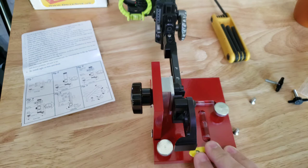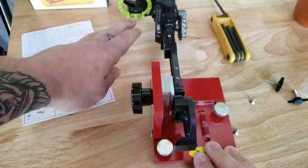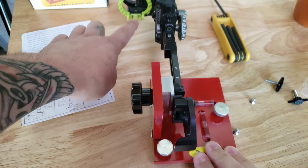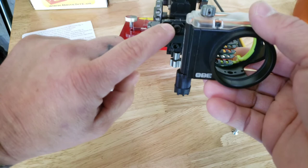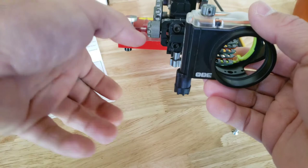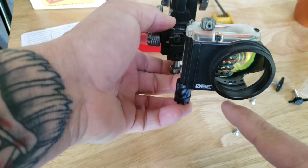This is actually what you're checking for second axis. Now that you've adjusted this — if you do need to adjust it on this specific site — it's these two screws right here. The top one you loosen just a hair, and the bottom one you loosen and you're able to rotate the housing, swinging it either up or down to adjust the bubble to where you want it.